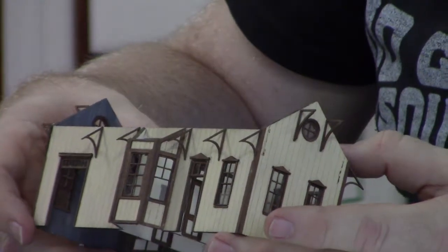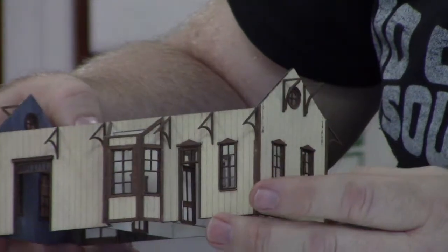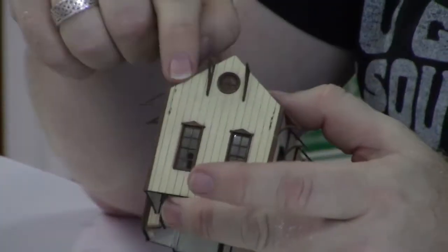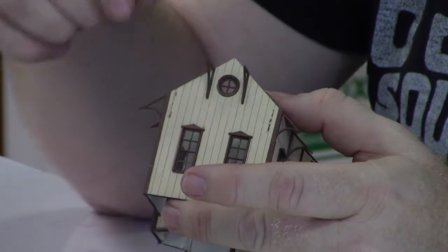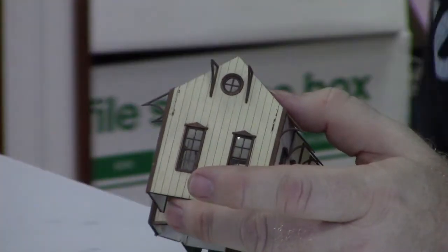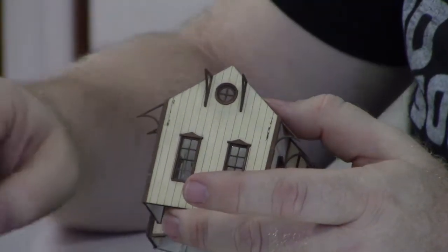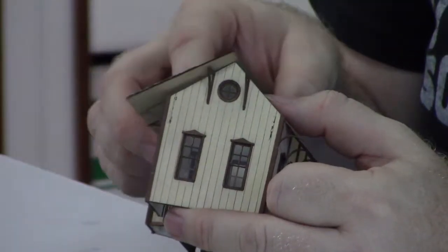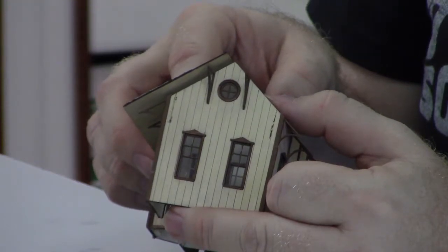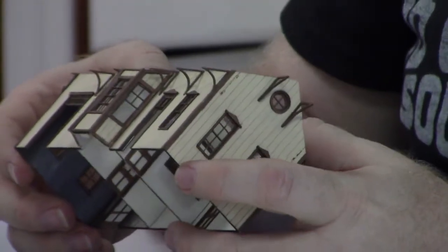On the other side is where you find the other bracket. And what you're gonna find there, and it's a little hard to tell, but one wing is a wee bit longer than the other one. Well, the best way to tell which way it goes on is to lay it on the side of the roof and look at the way the angle does. If you mount it one way, the angle matches the pitch of the roof. If you get it the other way around, it doesn't match. You don't want your roof coming down and then trying to duck out real quick, and then go back out again. You want it to be one nice, smooth transitional line like you can see there. So that when the roof lays on it, you get this kind of effect. Okay? Those are spaced wherever you want to put them.